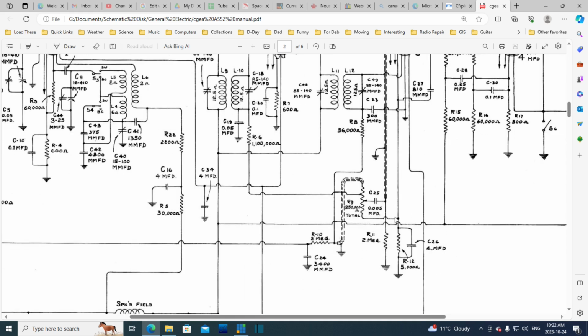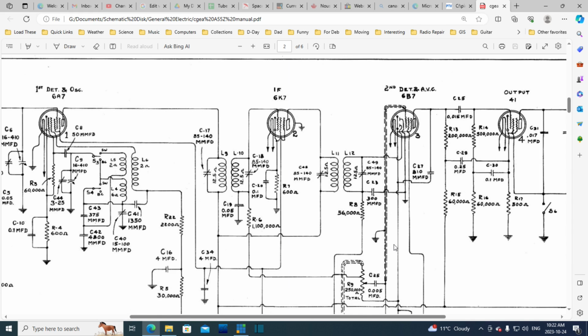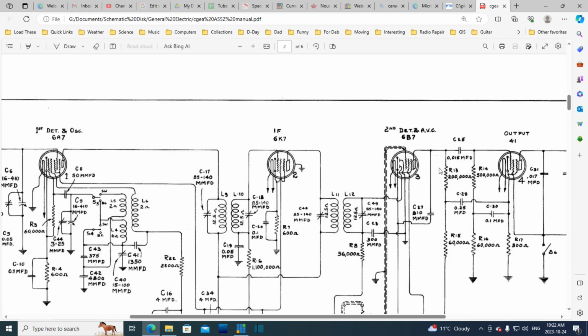Okay. Now, the audio signal comes through the capacitor, finds another shielded wire, goes all the way up to the grid. Why shield this wire? Because this is the very sensitive tube or sensitive location in the audio circuits. Any little tiny signal on this line makes a big signal come out of the speaker. That's how it's supposed to work. Just supposed to be the signals you want, not hums or other things. So shielded wire here. And once it's been boosted by this tube, you cannot pick up enough interference to be noticed in the signal anymore. The signal is overwhelmingly strong compared to noise signals, so they don't bother shielding any of this.